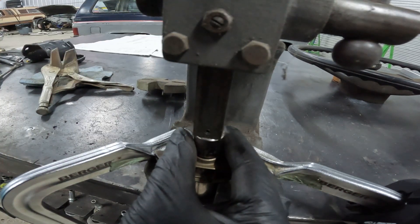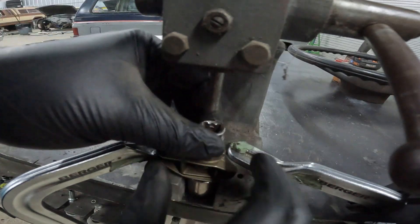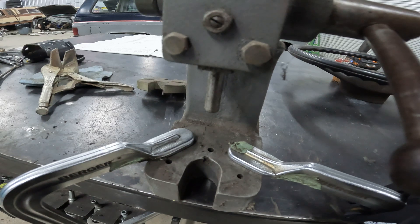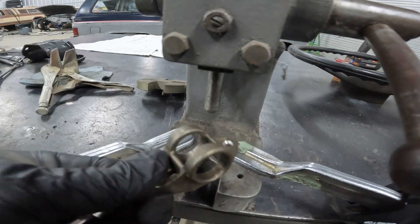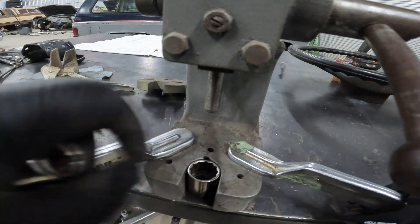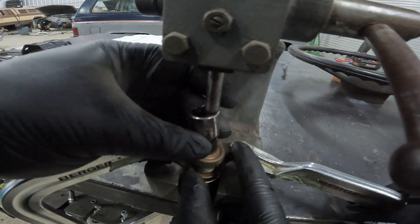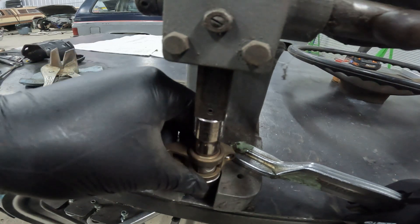The most important part is making sure it's all lined up. It doesn't take much to push it out. Pull back a bit, then pull the whole assembly out — socket and everything together — don't tilt it. Take it over to your bucket, pull it apart, and everything falls into the bucket and doesn't make a huge mess. The trunnion's all out. You just have to make sure when you press these out that it's straight and flat — not crooked — because if it's crooked it's going to destroy the rocker, and then you have to find a new rocker.